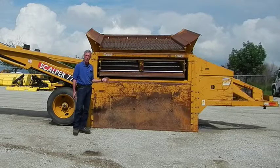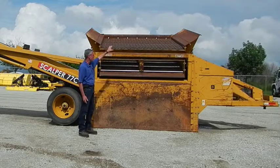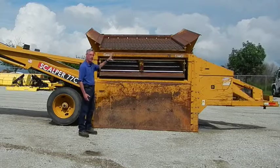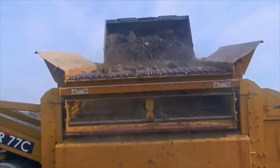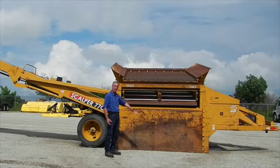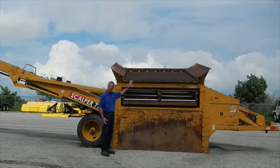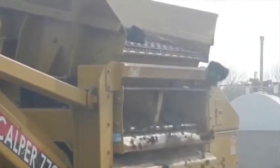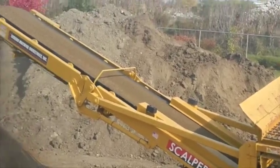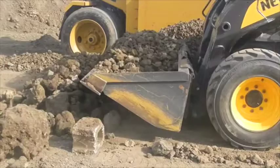It can be used either for stone or for soils and dirt. The material gets dropped in the top, and the upper section revolves in a shaking motion to shake oversized material off the top, which ends up on the ground. The smaller stuff that fits through the upper screen lands on the lower screen and goes out to the finished position on the conveyor. The overs from that also land on the ground, which you move away with your loader.